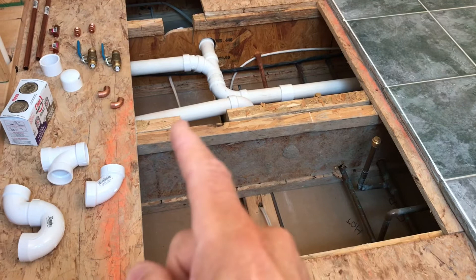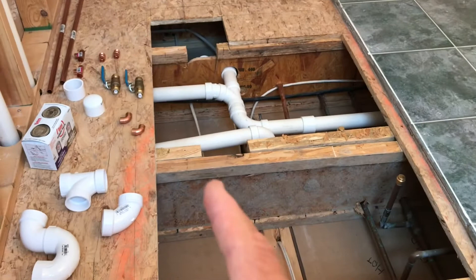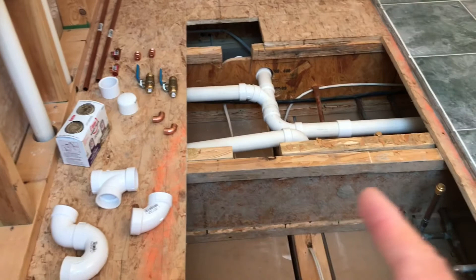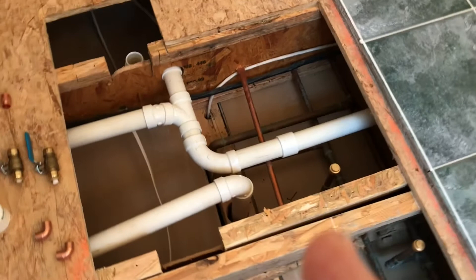The reason for the two I-joists here is they did a good thing — when they cut this one they thought they were going to have room over here, but it looks like they miscalculated. They needed to cut the top of the I-joist on that side, cut here, and it wasn't necessary, but they did splice that one out. The main weight of the tub is going to be between this joist over here and that joist. The supply lines — this line is going to have to be elbowed and cut through both those joists, and the other supply line is already over here.